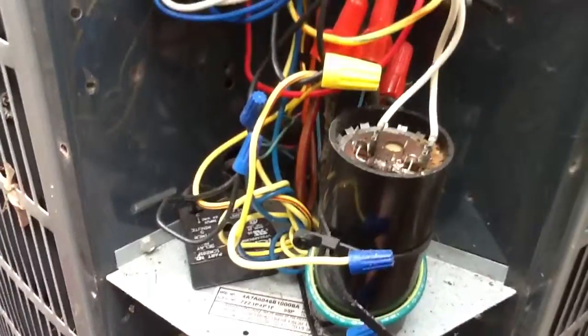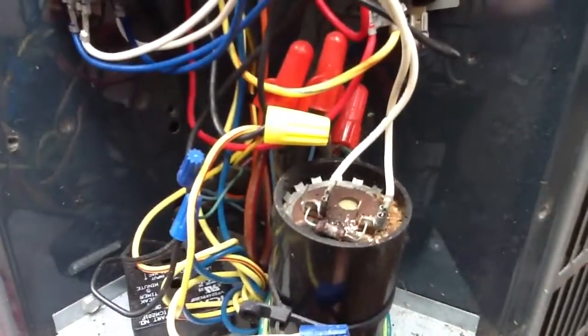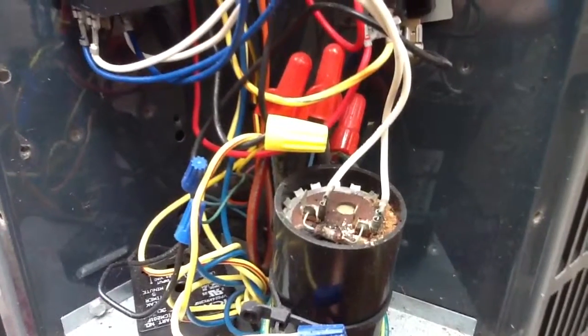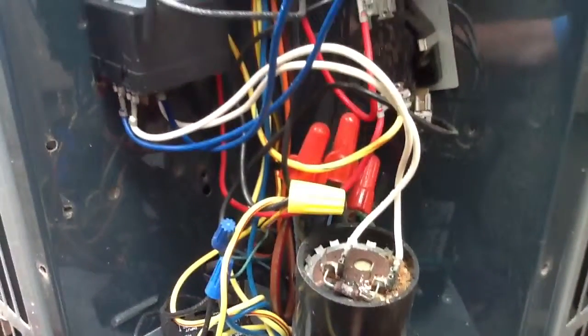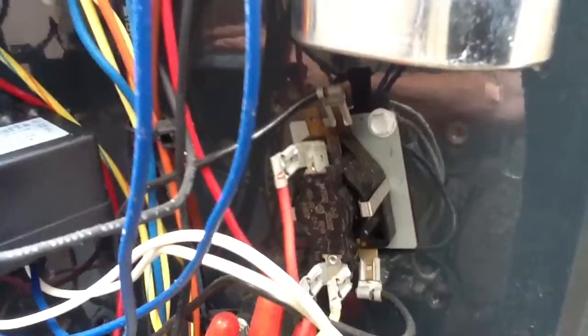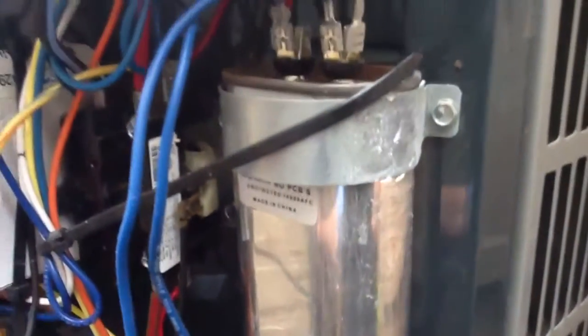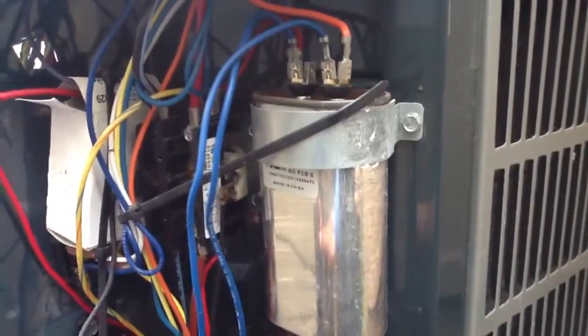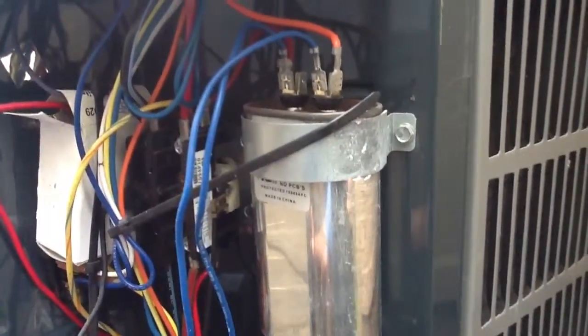You just set it five minutes. You have a kick start, which is what we use on Trane condensers and American Standard in this case. That actually is a heat sequencer — you normally find that in an air handler, but we're just talking about nomenclature parts. That is a combination capacitor.